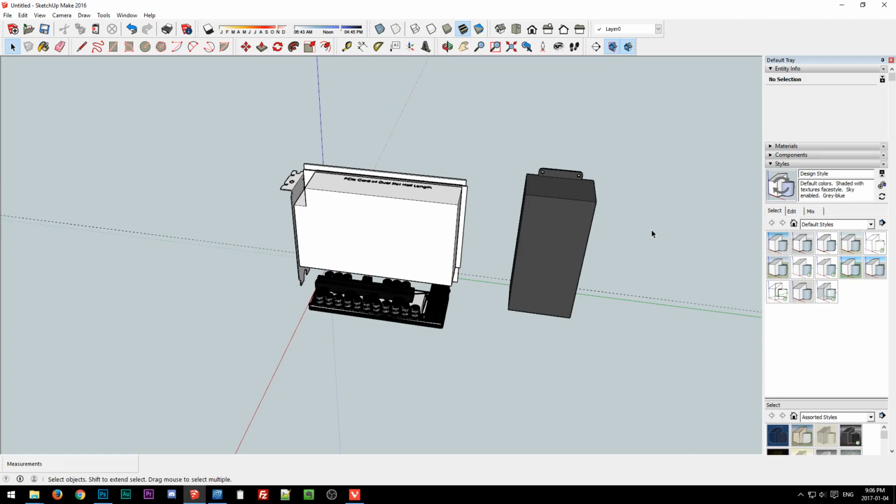A lot of that is that they would be able to really quickly spike up in power, render out what it needs to, drop back down, and then ramp up, ramp down, ramp up very quickly. So it would average out at a lower power draw, but the very peak could be just as high as the 700 series. And the Nano is like that, but even more. It spikes really badly. On average, its power consumption is not that bad, but it's very, very spiky. We're talking really short amounts of time, it will spike up very high.